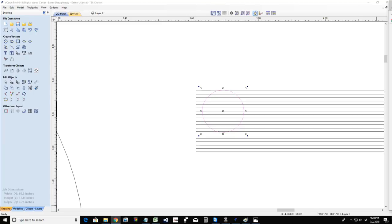If I'm running my 1.25-inch surface planing bit, I'm running that between 14 and 16,000 RPMs. I'm taking 0.03 depth of cut, 30 thousandths of an inch. I'm running around 75 to 80 inches a minute with it. And that's my settings. Doesn't have to be yours. You set up your tool database the way you want to.